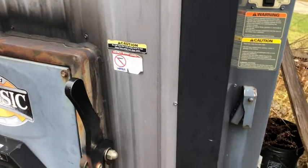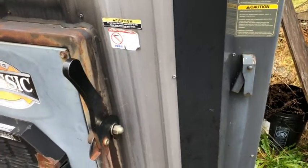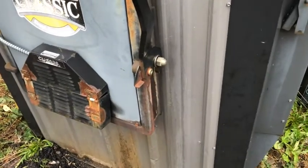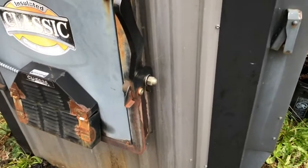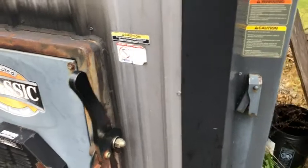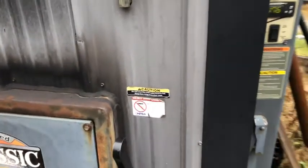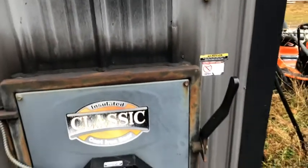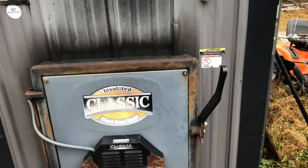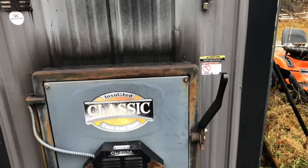These don't draw much electricity at all — this one at best draws about two and three-quarter amps when the draft door is open. You can run it on a battery inverter or a little generator, but if you don't know the power's out, how do you know you need backup power going? One in the morning, 20 below zero, wind screaming, power goes out and you don't figure it out for four hours — you're gonna have a problem.